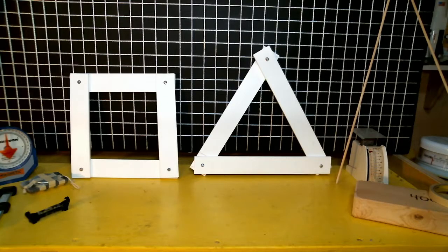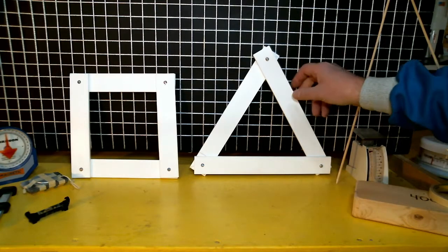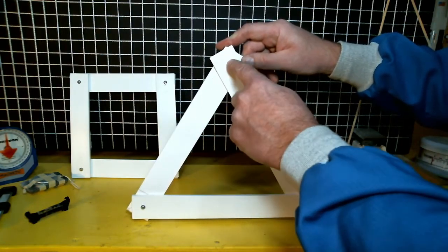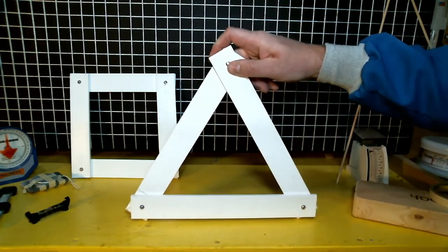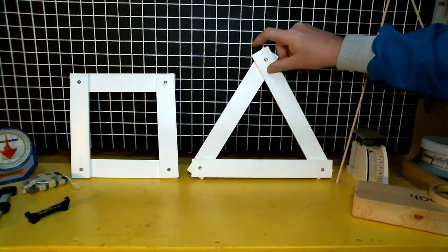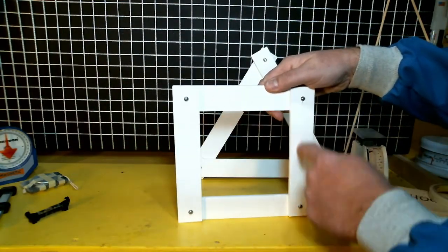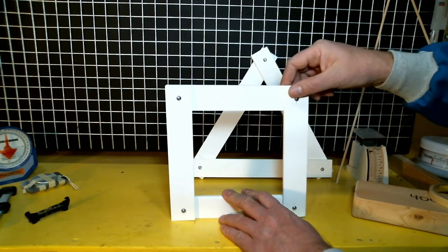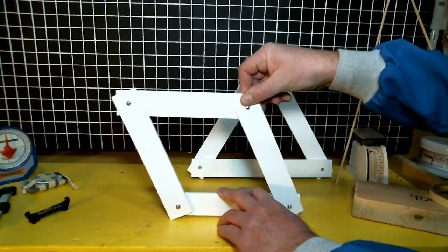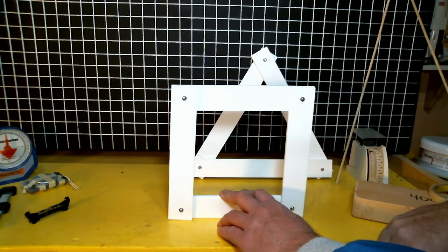Before we get into the analytical details, let's take a look at some of the geometry that goes into building a good structure. If you examine various bridges and truss structures, you'll notice they use a lot of triangular shapes. A triangle is a very stable geometric shape. Here's my triangle structure — each of the members are pinned together at the corners. If I apply a force to the left or right, the structure remains very stiff; it doesn't change shape at all. In contrast, if I were to use a rectangular structure with beams attached by pins at the corners, and I apply that lateral force, the structure itself deforms relatively easily. That's not a good geometric shape to be using in structures.